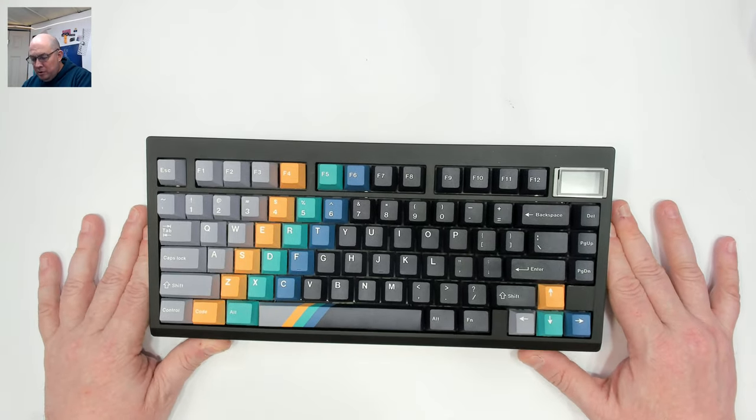So this is obviously crooked that way, so we want to straighten it out a little that way. I'm just gonna be real gentle with these pliers so that we can get this. And pliers will usually help flatten it out if it's got a curve to it. And then, like I said, you want to make sure that it's parallel to the other pin and perpendicular to the base. All right, that should be good. A little bit more. And then kind of want to come in from the back, make sure those pins are getting into the socket. Good.